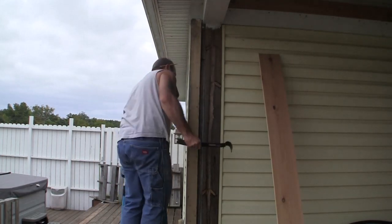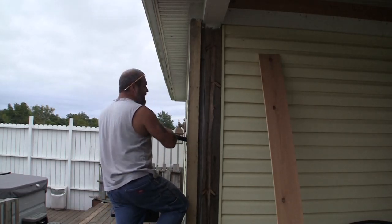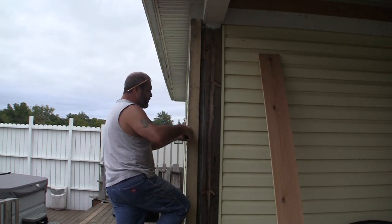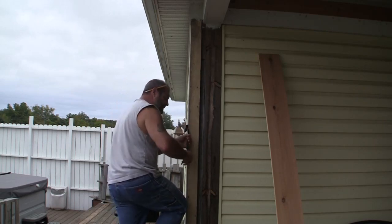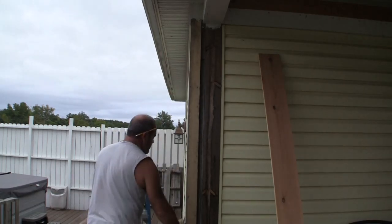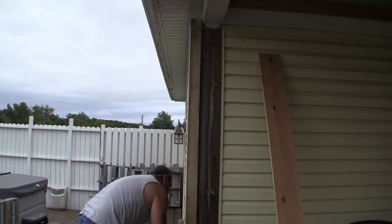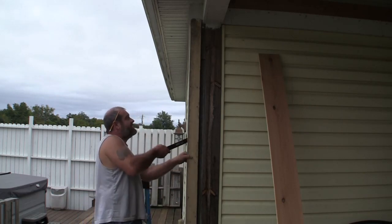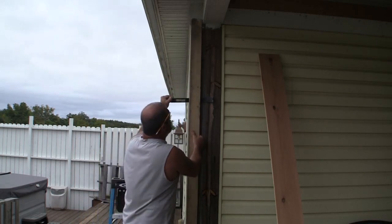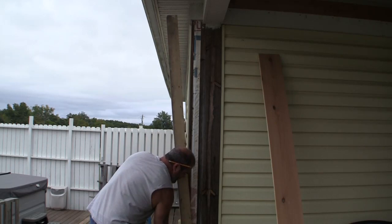Something when you're using a crowbar like this, well, it's actually called a pry bar. A lot of people put them in like this and try to force things out. If you can get it in with the curve against the wood, you can push down and you get more leverage pushing this thing down. I know that's like physics that you haven't heard from since you've been in high school. Maybe, I don't know. But it causes the lever. And you can get more pressure, and it's not as hard on your body. And then, when you get to here, you can pull stuff out. There we go.